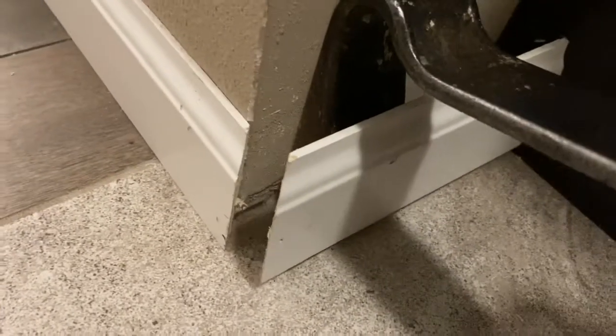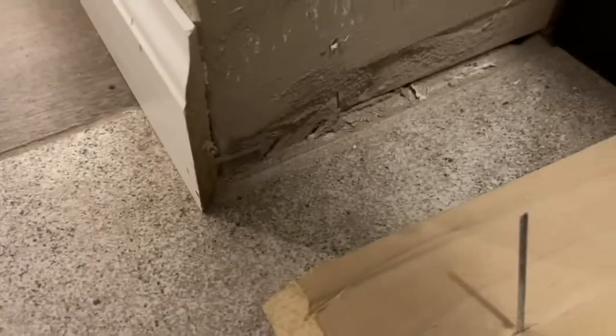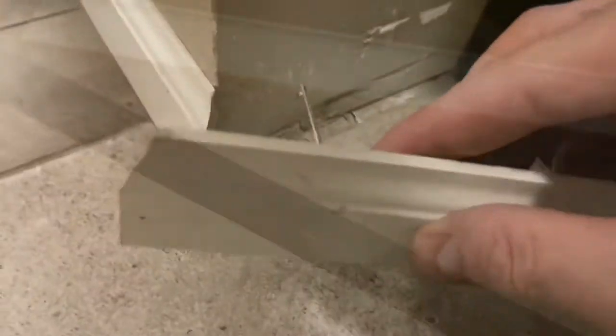In this case, I got a little lucky. There's not too big of a brad nail going through a little one. So you can just look there first, get a flashlight and see what you're dealing with before you pull that all the way off. Otherwise, you can create some major damage to your drywall. But that's kind of the idea.